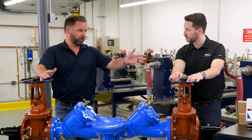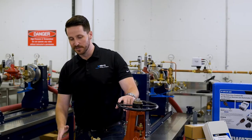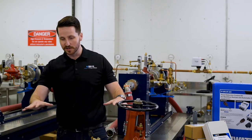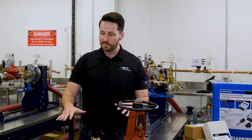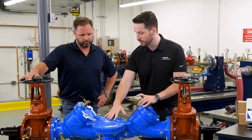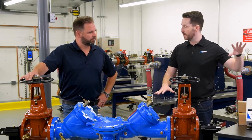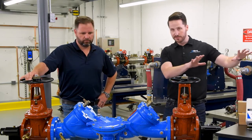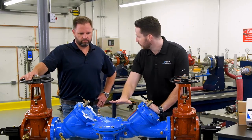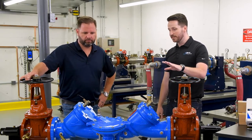We're looking at a traditional Watts 4-inch 909. They're installed everywhere, all day, every day in America and worldwide. We are trying to enhance this for our customers, and we get a lot of feedback from contractors trying to figure out how to make their lives easier in the field. Your backflow preventer is your safety device — it is helping us keep our drinking water system safe. One part of how it does that is it has this relief valve. What the relief valve is here for is if something goes wrong with the backflow preventer and you potentially have something toxic downstream, it's going to make sure that all of that toxic water, rather than flowing back into our drinking water system, goes out the relief valve and down the drain. So it's doing its job — it's getting rid of the bad stuff.